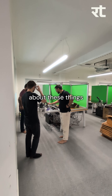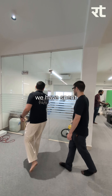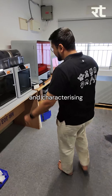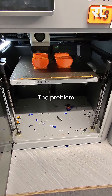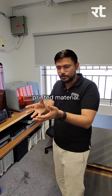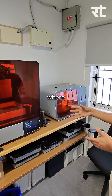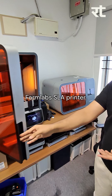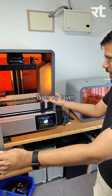These things have actually been 3D printed. We'll take you to our 3D printing bay. We have spent a lot of effort collecting and characterizing a variety of 3D printers. This is where we do FDM 3D printing — as you can see, a part is getting printed right now. The problem with FDM is that while it is great and cheap, the errors originate not just between layers but also within the layers of the printed material. To avoid that when making industrial grade parts for robots, we've got a SLA printer where we print everything line by line.